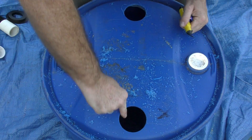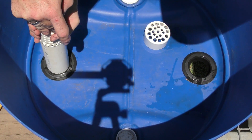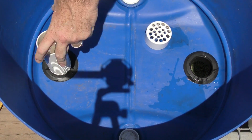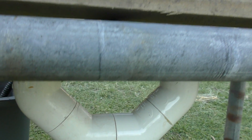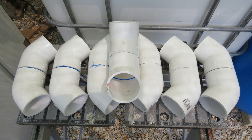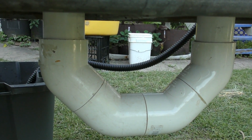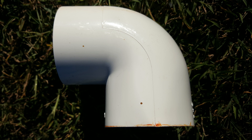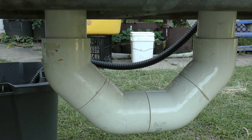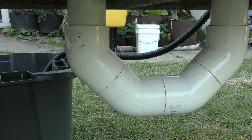I like to make them all nice and clean. From there, all I did was push the pipes down through into the uniseals, just down to the holes in the base of the standpipe there, and that gave us a nice section underneath the bed. What I've done is used two 45-degree elbows glued together — they've actually come from our old fish farm build, bits and pieces from that, so I've just reused them here. You could use a 90-degree elbow if you wanted to, but I've found that having this double 45 to make up a 90 degrees does make water flow a little bit more smoothly through the system. Thank you very much to Mr. Paul Van for pointing that one out.